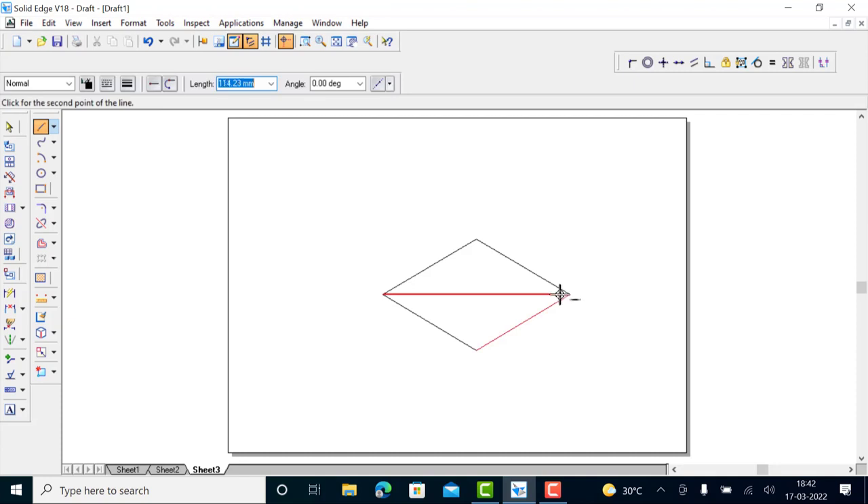Now close this side by picking the end point. To draw the base ellipse, first connect the two diagonals, then connect to the midpoint here and the midpoint here. Then use the center point — pick this intersection — then draw the arc approaching from below. Select the midpoint or end of this line and draw the arc till it meets the midpoint. Select the intersection and approach the end of this line or midpoint of this line.